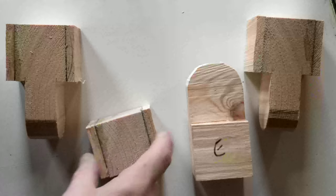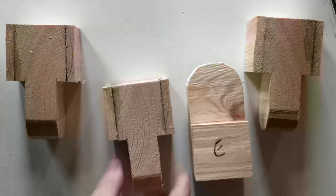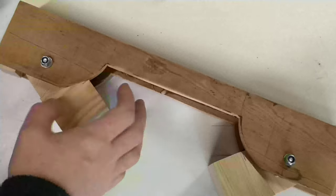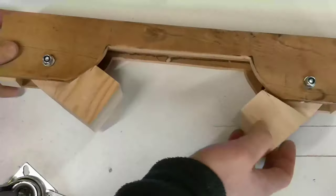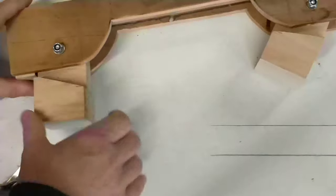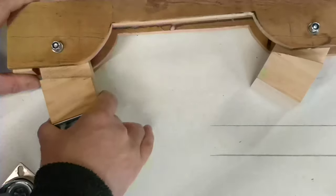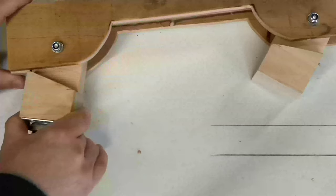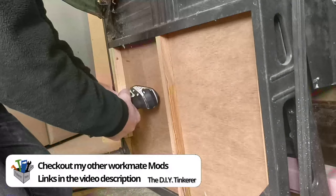I've glued up the extra on either side so that it's thick enough to take the caster. I'm now going to sand them down and make them a bit more presentable. I now need to glue these end pieces in — this will just give the frame a bit more rigidity at each end. You're probably starting to see how this is going to work. You've got these legs that fold up like this that the casters are going on. You might be thinking what's going to stop it from closing in on itself, and I'll show you why that's not going to happen later. The wheels will be fixed to the frame but first I need to add a filler piece to provide more surface area to fix to.